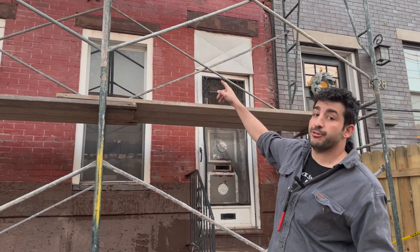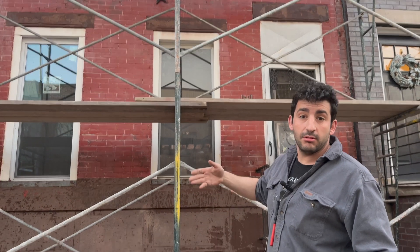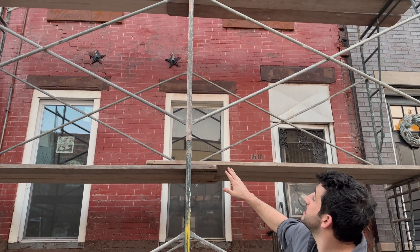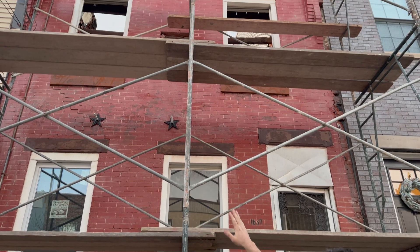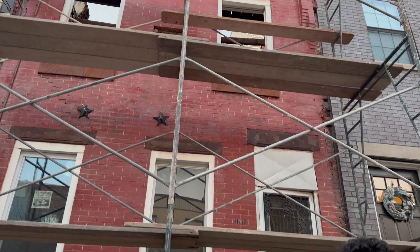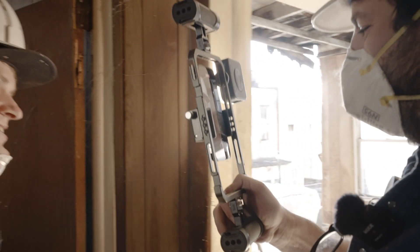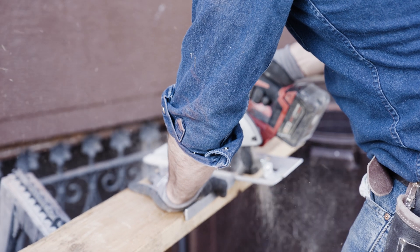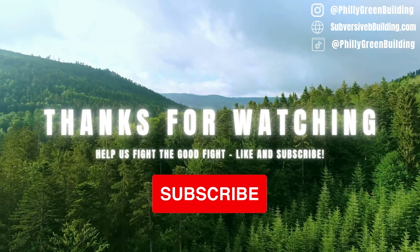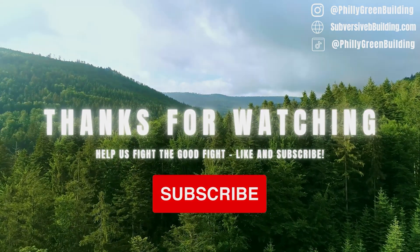Star bolts are in. We're going to get one more up top after we get some framing in the walls, but there's been no movement on the wall, which is a great sign — it means there's no immediately quick settling. That being said, we have scaffolding set up and we're getting ready to point. Once that's done, we'll finalize everything, seal the star bolts in, tighten them to the proper tension, and hopefully they will never be touched again. If you're still following along, we hope you enjoyed what you saw — it means you like building houses almost as much as we do. Be sure to subscribe and toss a couple comments or likes our way; it truly means a lot to us. Thanks for tuning in and we'll see you on the next project.